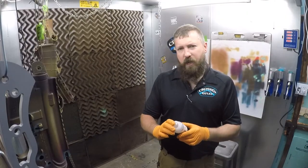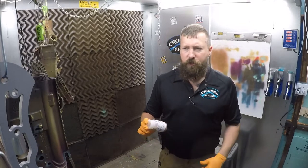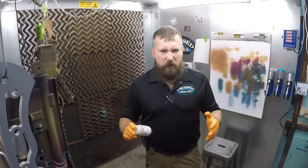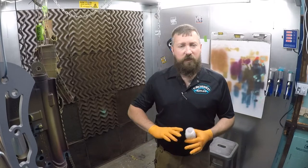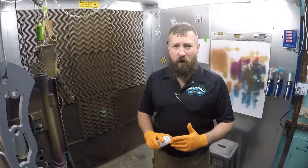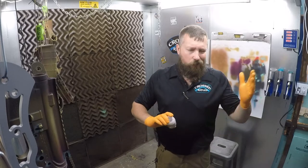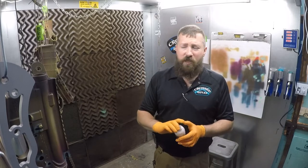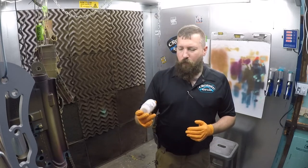Hey guys, Luke here. I just wanted to come in and add something to this project that we were talking about this morning. You've been watching Dave — and James was helping — do this patinaed bronze distressy thing that Dave does a phenomenal job at. We always go through and clear coat those jobs; it just looks better clear coated. We do like to use the H series clear coat that we can bake off in the oven, but these projects have all been completely cured overnight. I came in late and turned the oven off, so we're going to use air cure — MC-160 — to coat most of these and give it that sheen and a little bit extra protection.